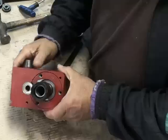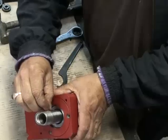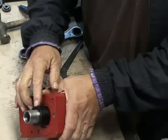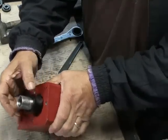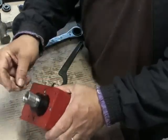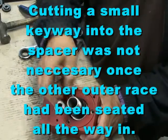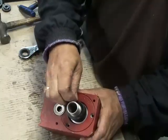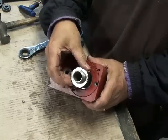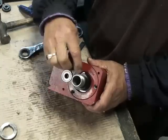The spacer goes on the drive side of the gearbox, and there's a little key right here. This spacer had to be turned down to 1.14 of an inch — approximately 1/10 of an inch had to be removed — because the new bearings are a little bit fatter. I found that with the keyway, I'm going to have to mill a little bit of a slot into this plastic because the key will not fit in the keyway properly. You need the full length of the keyway to engage with this gear correctly, so I'm going to now mill a little slot in this.